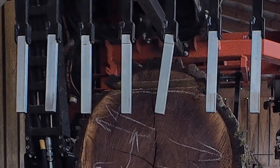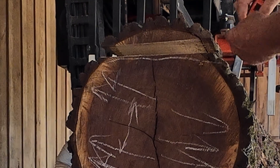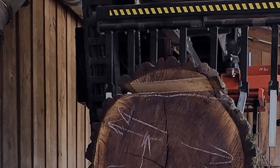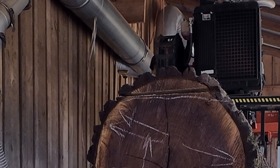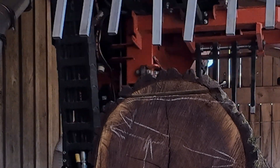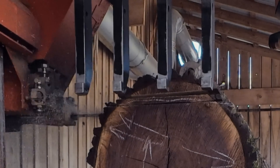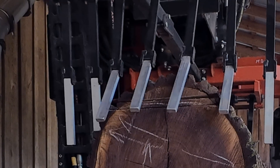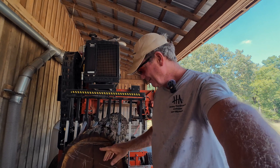There we go — almost one and three-eighths inches. It's stretched. That's called sapwood pull. I'm going to go down and cut another one a little bit lower. This one still has stress in it, but notice it doesn't have nearly as much. This first board had an inch and three-eighths of bow on it. Drop down a half inch and I have maybe an eighth. That's important.